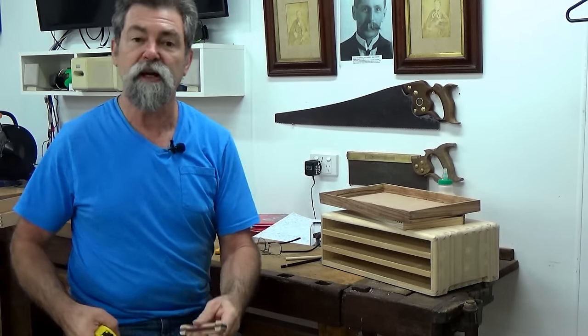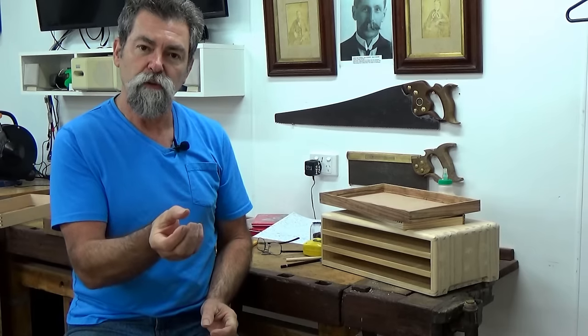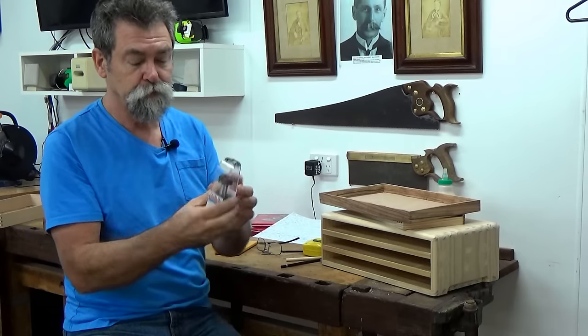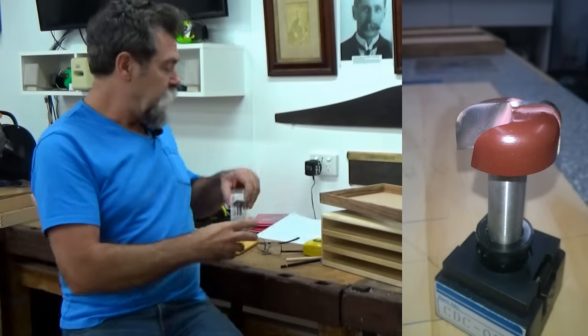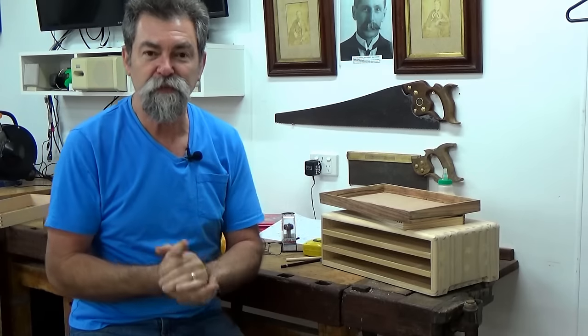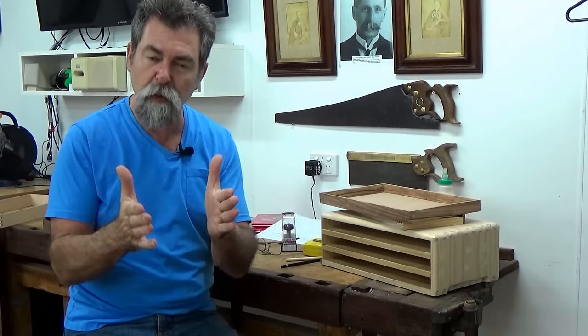The length was five and three-eighths inches, which is 135 millimeters. I wanted to create a rebate for my fingers to get a hold of — so I'm not just grabbing onto the outside of the handle and slipping off, but rather a positive indent to grip and pull. I did that with a dish cutter — it's basically a nosing or core box bit, but instead of being continuous all the way they've separated it so it's flat in the middle with radiuses on either side. I popped that in the router table and set it to the depth so we were going through one of the laminates — the rock maple — by around two millimeters, going into the purple heart ever so slightly.